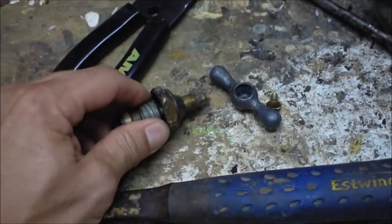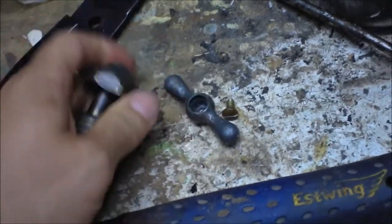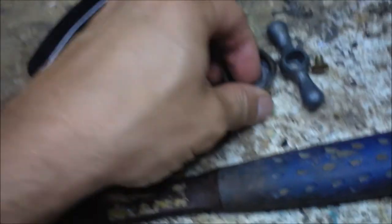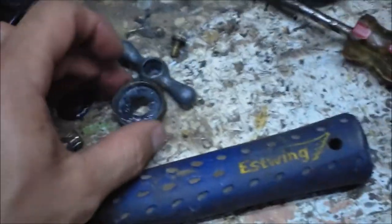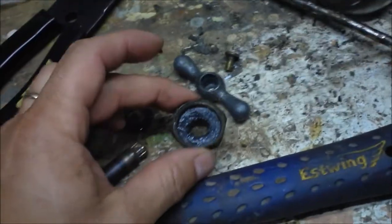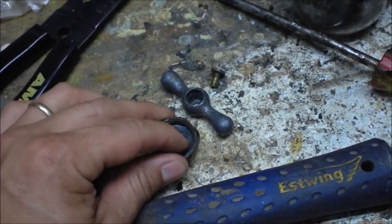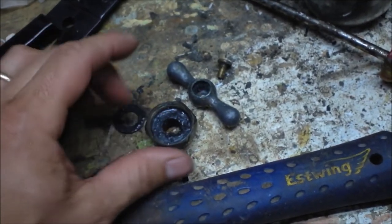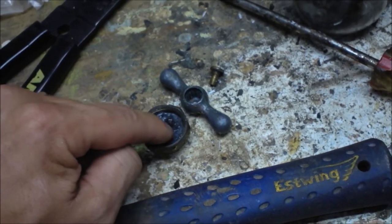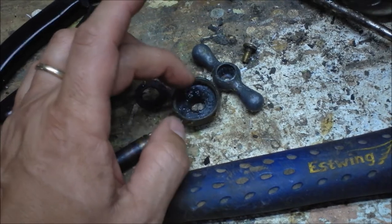Up inside here is where it gets interesting. This came off with quite a bit of struggle yesterday, but I put some grease on it and it's still dripping. First there's a washer, and then inside there's some sort of papery material — it looked like oil-soaked paper, but it turns out it's probably a graphite material. I got this stuff called graphite bead from Lowe's. The guy told me not to remove the old material, just add more bead on top, but that made me uncomfortable because I needed to pack it in tight.